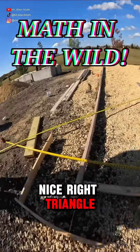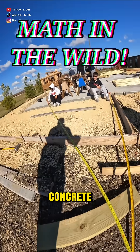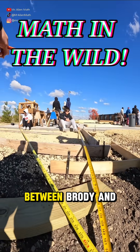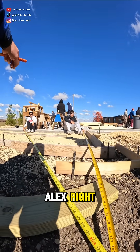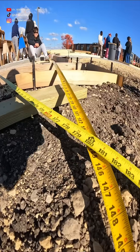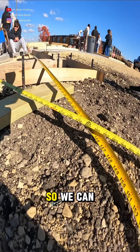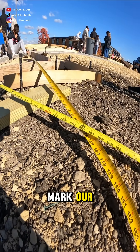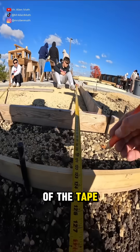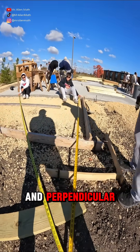That's a nice right triangle. Okay, are you good over there Alex? Right to the face of the concrete — yeah, bring in there a little bit. So we got nine feet between Brody and Alex, and 12 feet coming out this way. This is a three-four-five that has been tripled to 15. So we can mark our batter board right here — I got the inside of the tape — and that's where our string line can go. Now we've got it all nice and perpendicular.